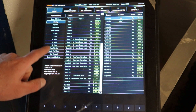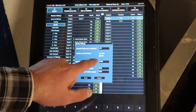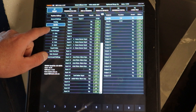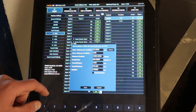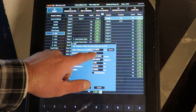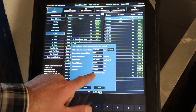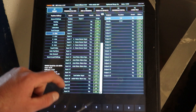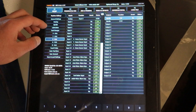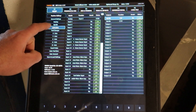The controller has a 0-to-10-volt output for the VFD control, configured under the spindle tab. You can designate the signal type, max speed, ramp up, and ramp down times of the spindle. Each axis has specific parameters required for the controller to accurately position and run the stepper or servo motors. Settings include the travel per revolution of the motors — determined by your screw pitch — pulse rate set by the drivers with microstepping (ours are 6400), acceleration, min and max travel, and backlash. Other cool options include setup for auto lubricators and various tool changers.